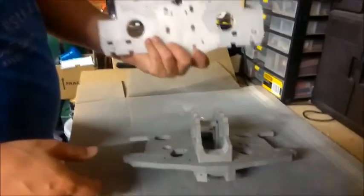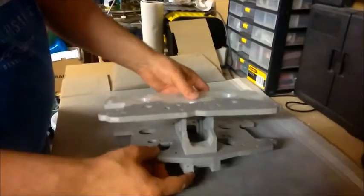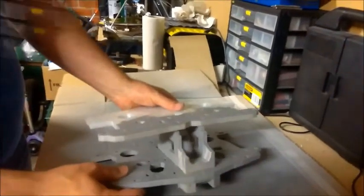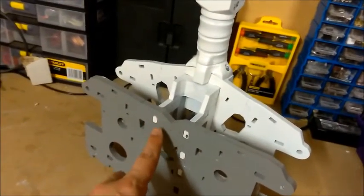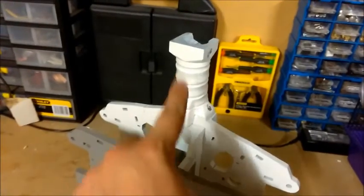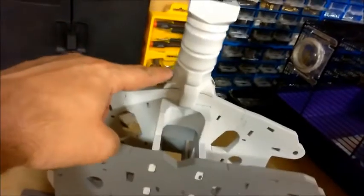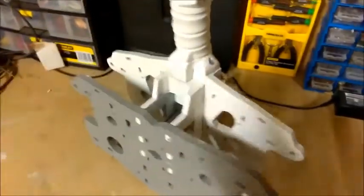The last thing I'm going to do with this stage is fit this front plate on here. This will have to come off again because we have to fit some of the shoulder parts in between these holes, so I'll just loosely fit it — I won't glue it in place yet. I've attached the front plate, filing all six holes out to get it on. I've removed the neck from the head I've already built, drilled out these two holes to two and a half millimetres, and used M3 machine screws to screw the neck in place.